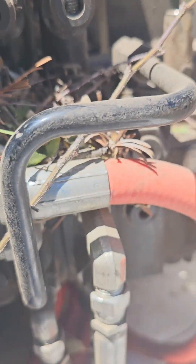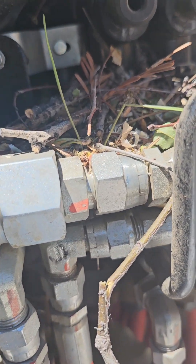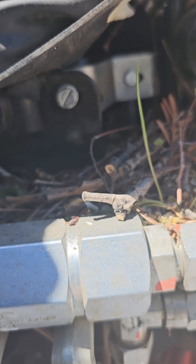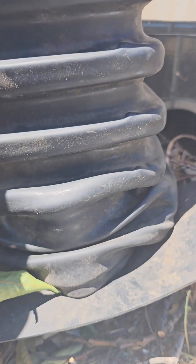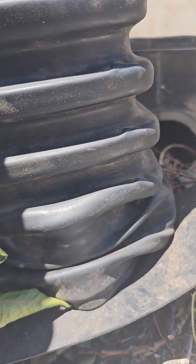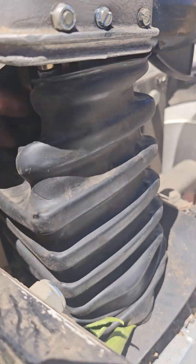This is an open center hydraulic valve, and as I squeeze the trigger it allows oil to flow through the valve. If it doesn't get full depression right here — and it's not, because when I squeeze the trigger and then push on it with a flat-tip screwdriver or pliers, it moves down a little bit more — that means it needs to be adjusted on this rod right here.